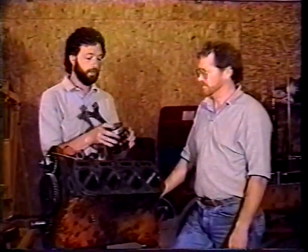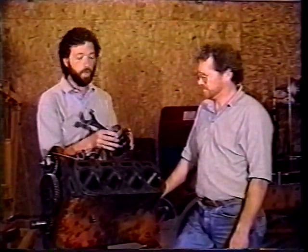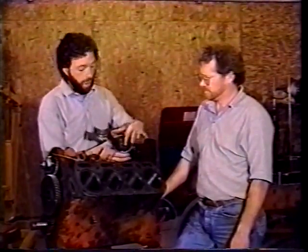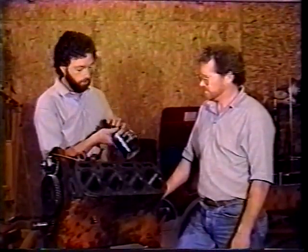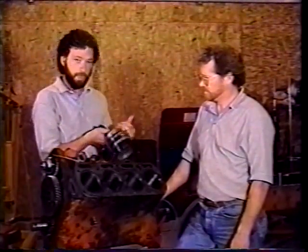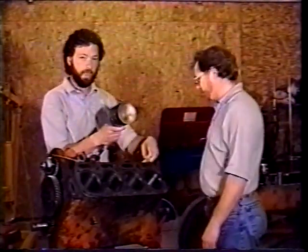We've got the piston ring, it's all lubed up, they're tightened down, ready to pop in the hole. But before we do, we've got to determine which way we're going to put them in. On the rod, they have a nut that tightens down on the rod cap. That nut faces, when it goes in the hole, the camshaft, which is along here. Also, the numbers on the rod and on the cap face the camshaft. So when I put it down the hole, I want to make sure I'm looking at the numbers on the camshaft side.